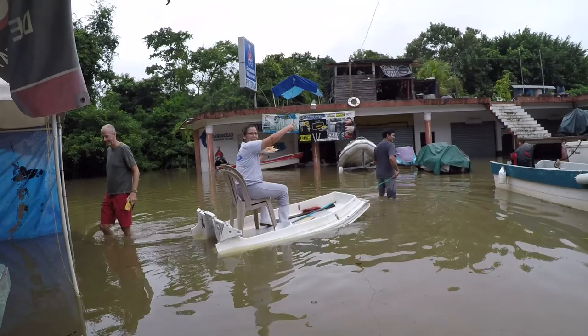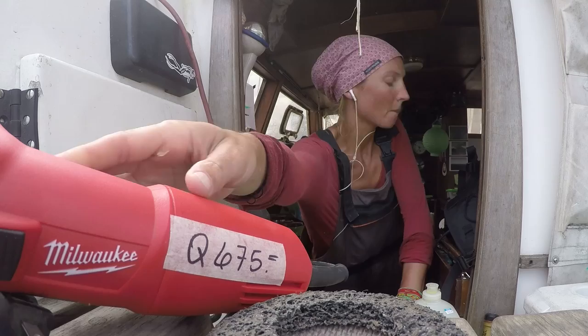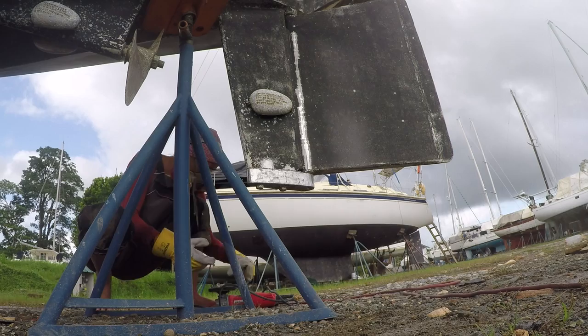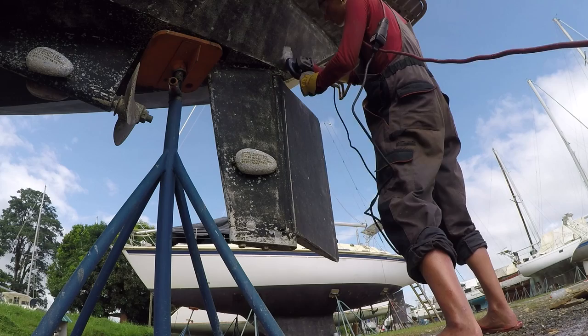I went to RAM Marina and they took me out of the water with a crane and put Karl on the hard, and I just scraped the dirt off his bottom, and then I inspected the underwater hull and everything looks good. The spots, there's like no more paint coming off, just tiny little bits, but in those, there's no holes or anything. There's a tiny little bit eaten away, but it was so small and not a lot. It's just because there was bare aluminum in that spot and it all looked good. So all I had to do was prep those little open spots where there was aluminum showing and etch prime them and prime them.